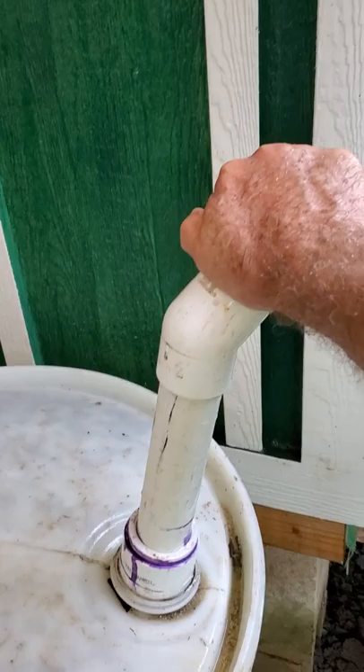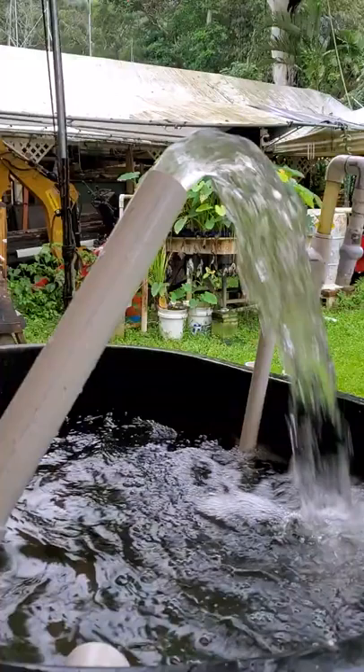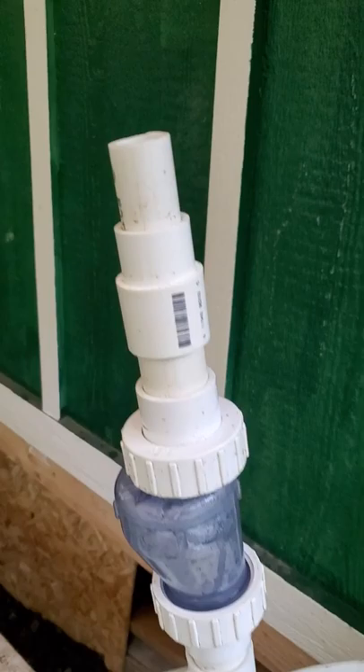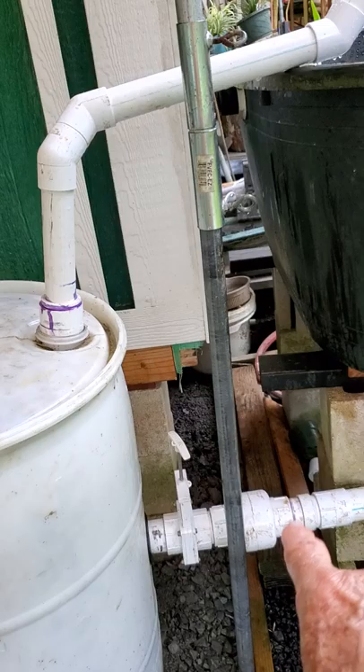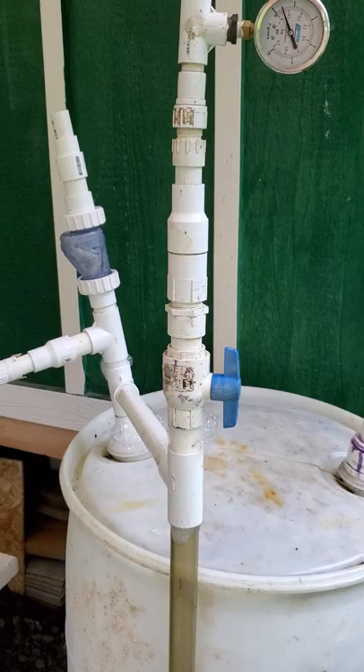When you get down to the bottom — it's the bottom of this pipe inside — she goes steady right to the end. There's virtually no reduction in flow. Even on a small pump, it's only about three seconds longer to fill up a five-gallon bucket at the end than at the very beginning, so we average that at about 12. She'll burp out like that — can you hear that sound? The valve opens up and the air goes out. Then the one-way check valve over here lets the water from the tank fill back in. The water in the tank is just gravity flowing. That check valve will seal as soon as that valve over there closes, and that valve will close when the flow comes up — it's tied to a string and a little spring — and then she'll run again.